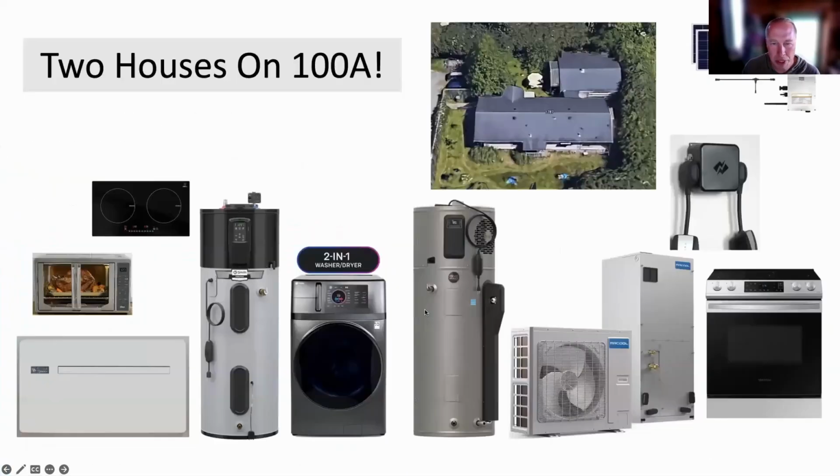The most common type of HVAC system, HVAC standing for heating, ventilation, and air conditioning, that I have is ductless. And the product that people are using, there it is, this here. It's the really popular one because it's the least expensive per room. A ductless system usually puts one fan coil on the wall per bedroom and in the living room. That's the way to comply with the code and make everyone comfortable. This is a type of heat pump that sits on the wall, and you cut two duct holes through the wall. It fits in between stud bays.